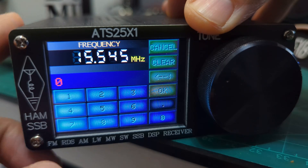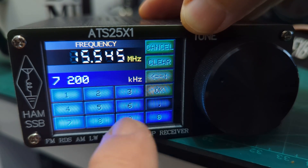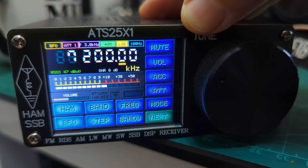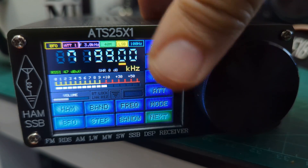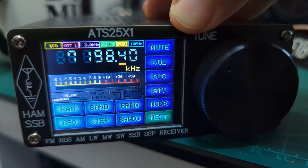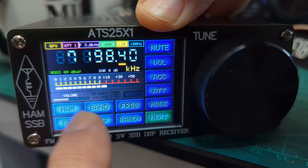I can't really find the specific frequencies that were asked for by typing directly, but let's try. The question was 7,200 kilohertz — typing that in takes us to the ham bands again, which makes sense since 7,200 kilohertz is in that range. You can also change the mode — pressing Mode gives LSB. There are digital modes, and this will receive FT8 and things like that, though I haven't really tried that.